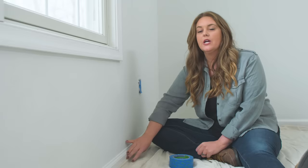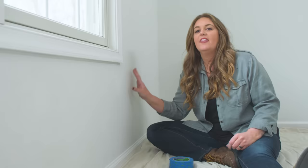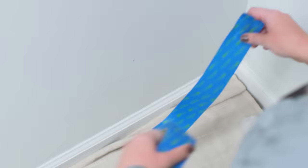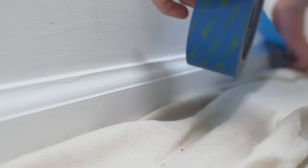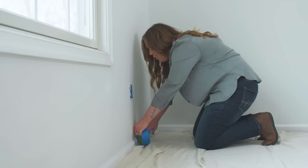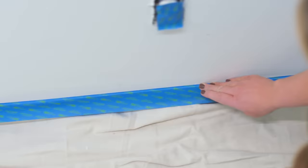In this room we're not painting the ceiling, but we are painting the walls and the trim, and we're going to start with the walls. This is hotly debated in the painting world — what do you paint first, trim or walls? Everyone has an opinion and you can make a good case either way, but for an average homeowner, we're going to recommend you start with the walls. That way, if you have any overspray or anything on your trim, it's the last thing you do and it really cleans up the whole job. So since I'm painting the walls first, my next step is taping off my baseboard and trim using two-inch painter's tape, starting back in the corner and lining it up with the top of the return. The key is to work in one long piece rather than small segments, so you get a perfectly seamless line.